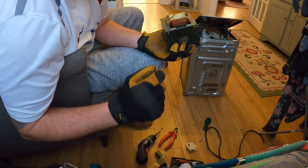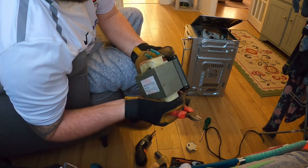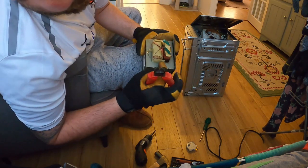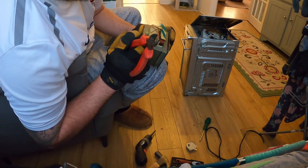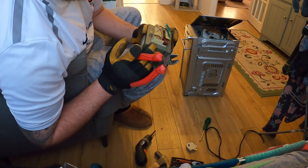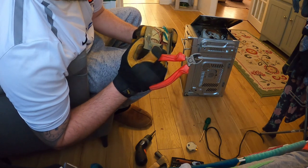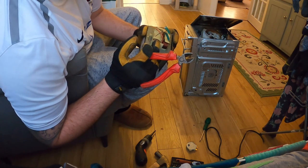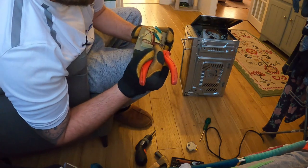Right, here's your transformer. Now, these transformers, you've got two coils. This one that's obviously wrapped up to the nines. This side's less wrapped, so I'll probably do this side. And this one here that's not wrapped. Now, the one that's not wrapped is usually aluminium. Sometimes this one is aluminium as well. If they're both aluminium, I will not take the transformer apart because it's just not worth the time and effort. Sometimes both of them will be copper. Sometimes the one that's lacquered, which is often the front one, will be aluminium, and the back one will be copper. Now, I'd say 98% of the time I come across these, they're both aluminium. But still, it's transformer weight, so let's...